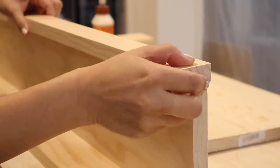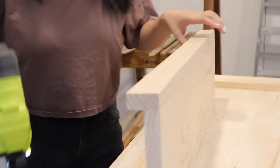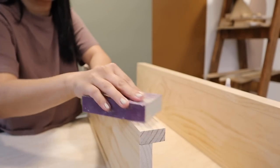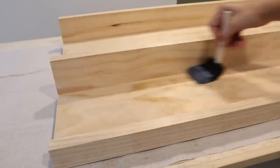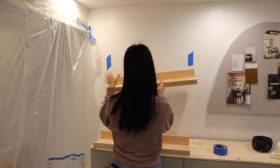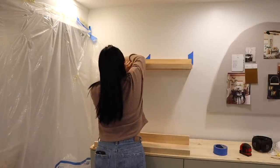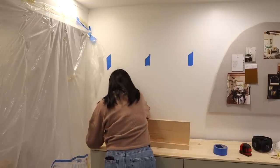For the lip, we're going to glue and brad nail a two-inch board to the front of that six-inch board - and that's all there is to these shelves. I just learned how to make these a week ago and now I can't stop. These totally give off a floating shelf vibe and I just think they look amazing. This is totally a beginner-friendly build, and really affordable - for all the materials I spent $30 and could have made three of these shelves.